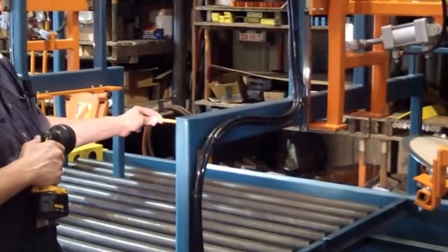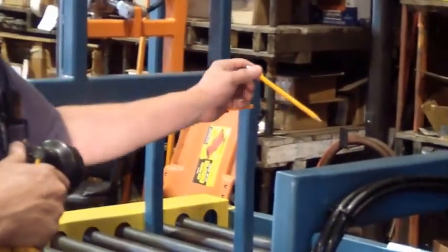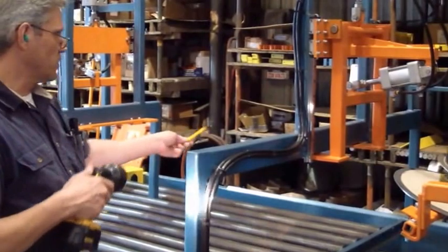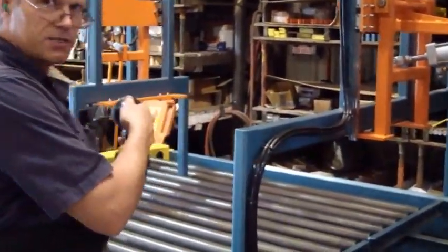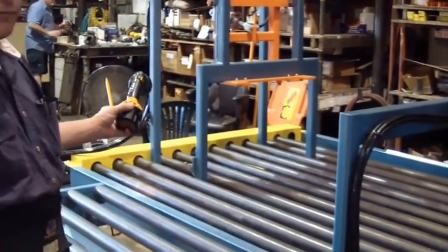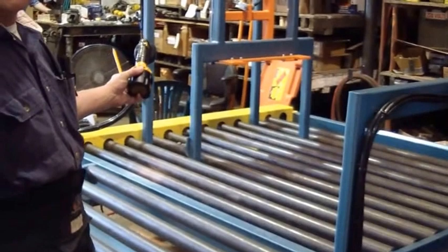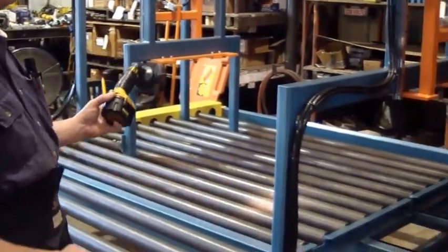The inside face to the inside face of over there. On this particular machine, you add 5 inches to your length of pallet so that the arms will stack it correctly. There's a jack screw on the bottom of that far stacker tower down below that holds it tight in position, and you just drag it either way.